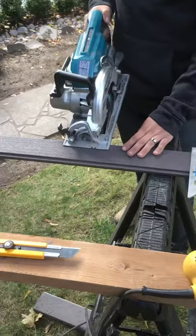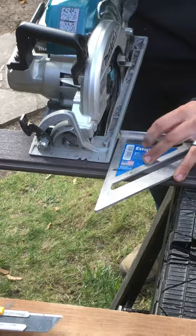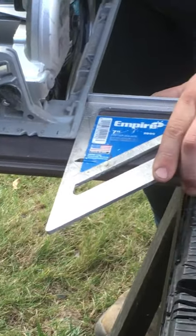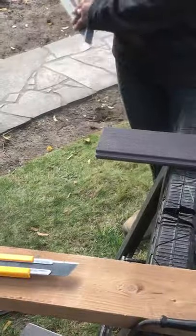You don't have the miter saw out, but you can cut it with this. I do it like this: line your blade up with the mark, put your speed square on tight, and then you follow the shoe against the speed square. That's it.